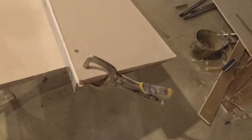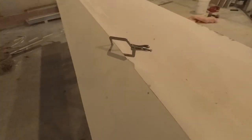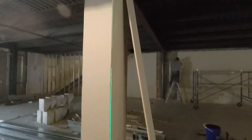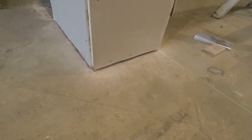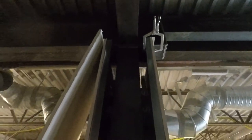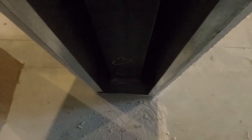This is another way to do it — you can pre-screw the angle on. This is just a second way of doing it. You can clamp it on and screw it while the drywall is already up, or you could pre-do it and put the angle on. First layer, guys, you want your corners to be tight all the way around. On the last layer, we want to keep a quarter inch back for the corner bead, but on the first layer, you want to be as tight as possible on the corners with the drywall.